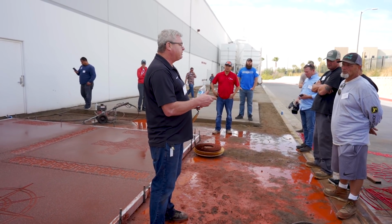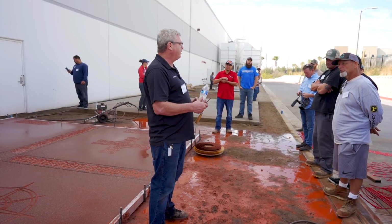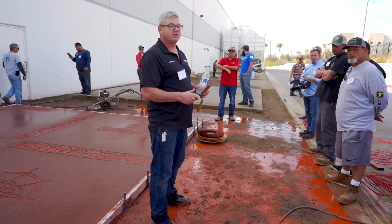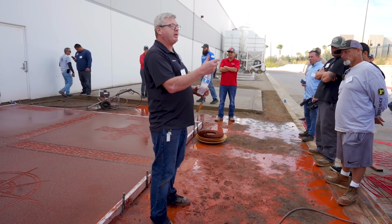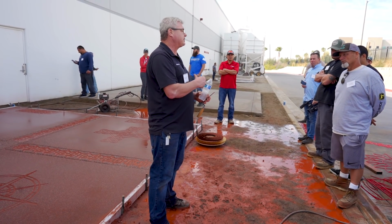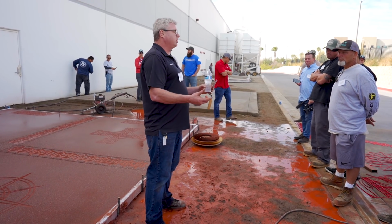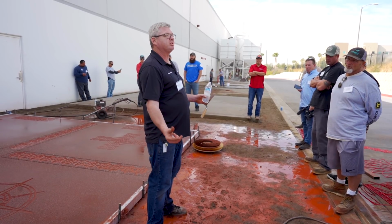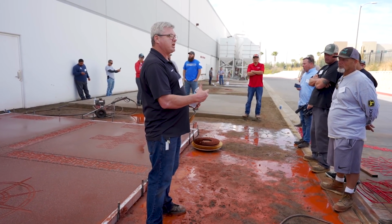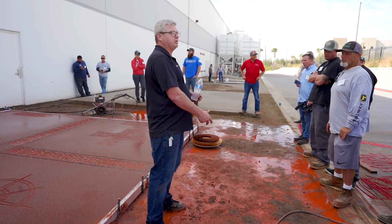That's the one thing that we did do developing this idea. I worked long and hard on a product that was durable and had memory. And that's what took me so long to get figured out. There's a lot of urethanes out there that don't have the memory. The way that we heat cure these, we really heat these things up. That's what gives it its memory. You can roll this up, shove it in your glove box, show up to the job, pull it out. Within about 10 minutes in most temperatures, it's just going to come back to its natural state. That's because of the heat cure. So how it cures out in that mold is how it will always come back to.